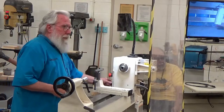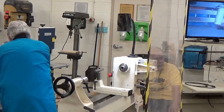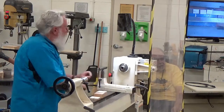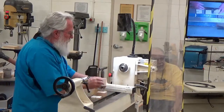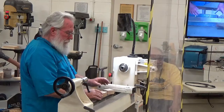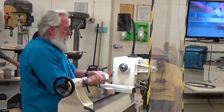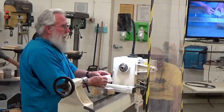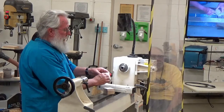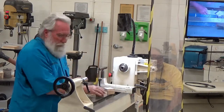One thing, I make sure the speed is down on the lathe before I start it. And the three pieces I need for those jigs are right here. I have the centers marked on the jam chuck, just one side. Collet chuck, just one side. And the eccentric chuck, both sides. And I didn't miss here. I have a second center, which is going to be an eighth inch off center. And that's for the finial.